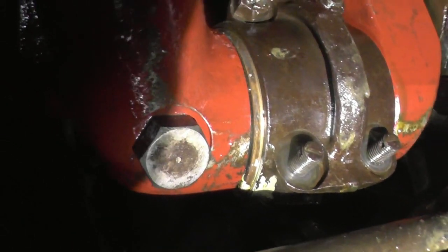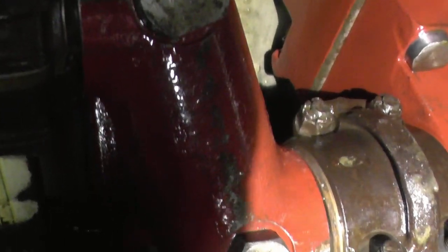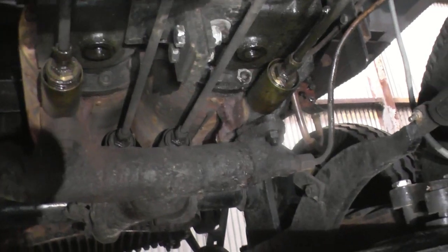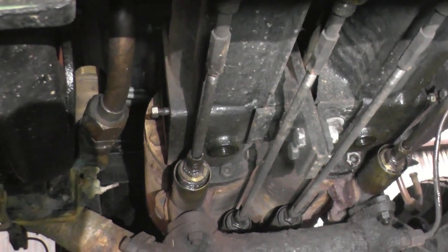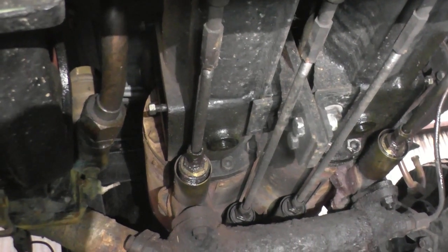As you can see in there, there's two camshafts as well. This engine's actually operated by poppet valves. There's a camshaft in the top and the one on the bottom. They work these push rods, and they open and close our valves. So basically, it is a steam engine, but it's using internal combustion engine technology part of the way with the poppet valves.